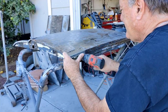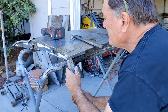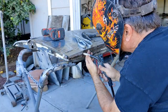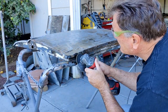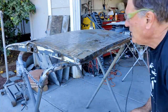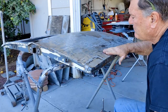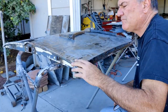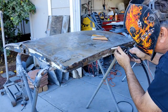If you're not burning holes sometimes you might not be getting penetration all the way through — that's really important. So I'm drilling holes to do the final plug weld and then welding up the corner you see right here, spot welding it, plug welding the finished area. Then I left a little bit of extra overhang and I'm trimming that to be level so it's exactly like the original piece. You always leave a little bit of extra metal hanging off on something like that and then grind it to the line.